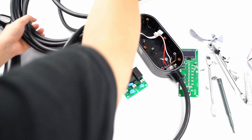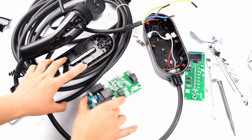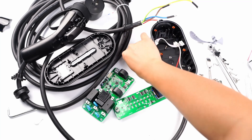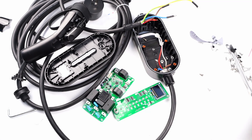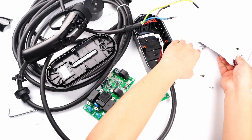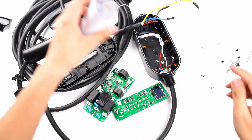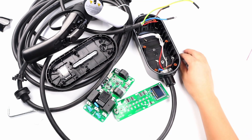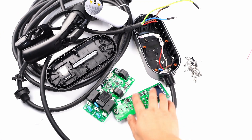That's all the components of this portable electric vehicle charger. The smart control module is easy to use and view. It supports IP66 standard and 8 or 10A current. You can also set it to start charging after 2, 4, 6, or 8 hours. It provides complete protection such as overcurrent, overvoltage, and leakage. The built-in thermistor can detect temperature, and the gas discharge tube can prevent lightning strikes. Two microcontrollers are used to control the charging status and drive the display. That's all for today's video. If you're enjoying this video, please drop a like and leave your comments. We're still exploring different power-related products, so if you want to see more content, please subscribe to us. See you in the next video.